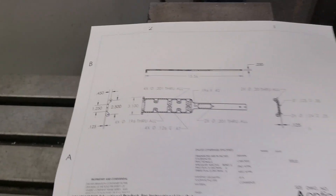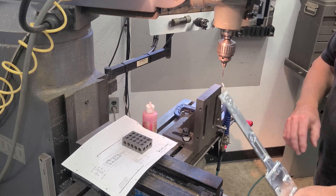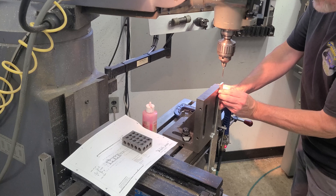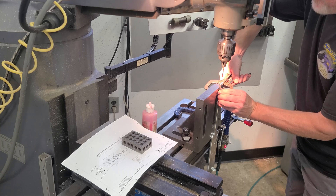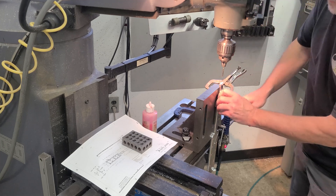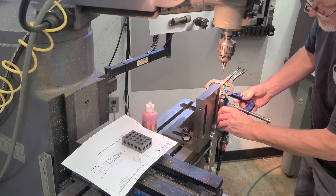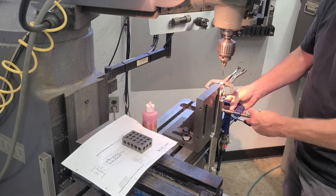So let's drill these holes. Okay, that side is finished. Now to do the other side, all I do is just flip the guy around, put him up against the same stops, clamp him down, drill and ream. This side is also a slip fit 1/8 inch. I've got a piece of Teflon in there to protect the surface, and over here I use a clean little parallel, tighten her down so it can't move around at all.